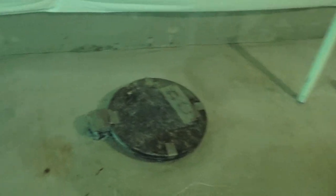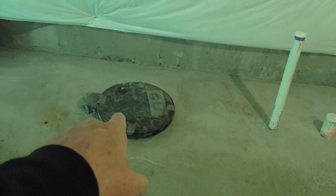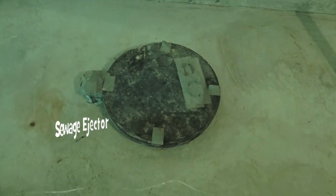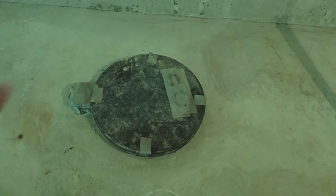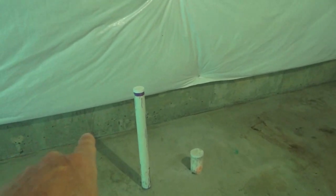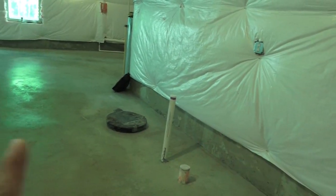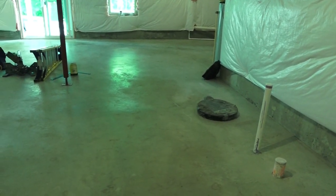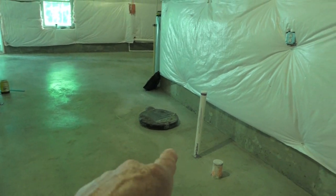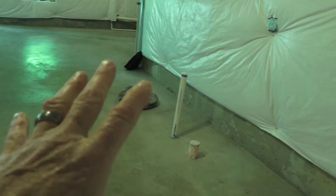So what we're going to do is eliminate the original plumbing put in by the builder. Let me spin the camera around and show you what the builder did, and where we've redesigned to put the bathroom so it works better with the floor plan. Right over here, as you can see — if you've watched any of my videos about bathroom plumbing — this is the sewage ejector pit. The sewage ejector grinder will go in here and all the bathroom wastewater will end up in that pit below the floor, put in by the builder. They also had a sink line here and a toilet line — just in a terrible location out in this nice living space.